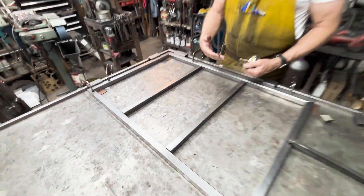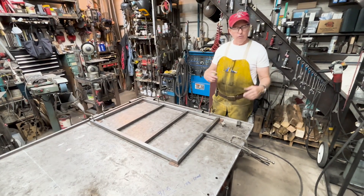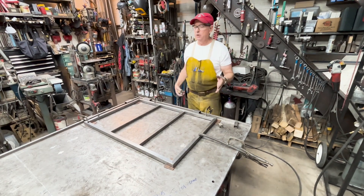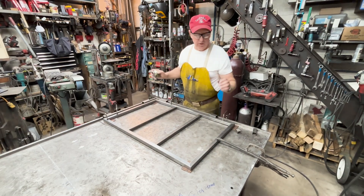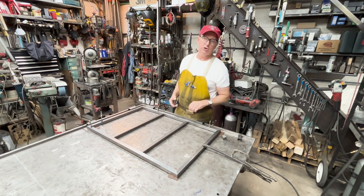It's a quick way to measure that. If you have to work with great accuracy, normally I'll switch to the metric tape so that I can be working in millimeters and the math divides out a little bit easier. But this way we have the lid with two cross members equally spaced. I'm going to go ahead and weld it off and then we'll continue with the sheet metal portion of the project.